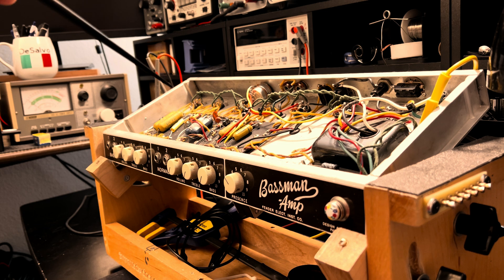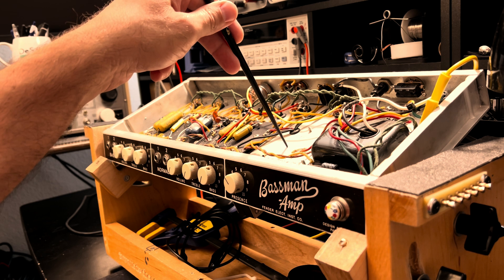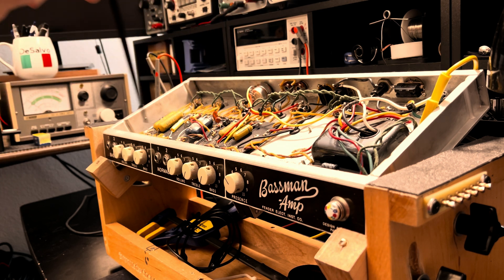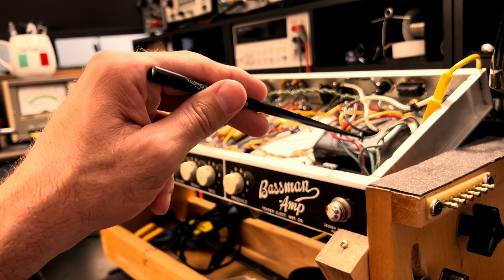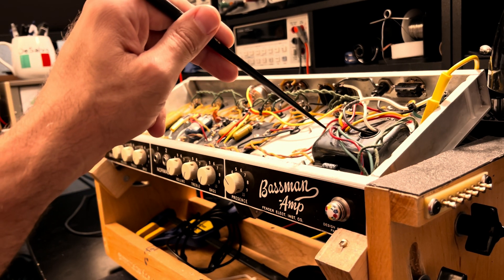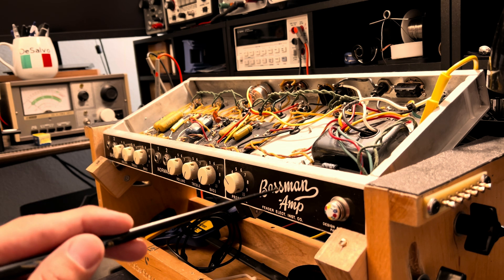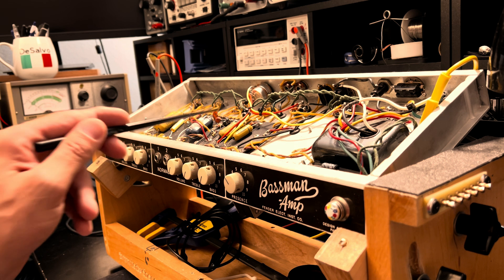It's the bare minimum, not meant for dropping voltages to suit a particular preamp tube, though it could be used for that as well - a dual purpose arrangement in conjunction with your plate supply and plate load resistors. On the back side you've got the 'made in Fullerton' paper-interleaved choke - paper-interleaved transformers are my favorite, by the way. This choke is dated to 1961, as are several of the pots that haven't been replaced. This power transformer is actually for the 5F6A reissue - a tweed Bassman spec - so the plate volts will not be what they should be for the 6G6 circuit.